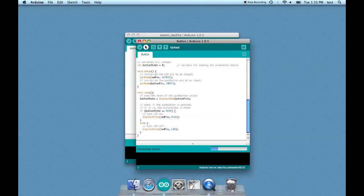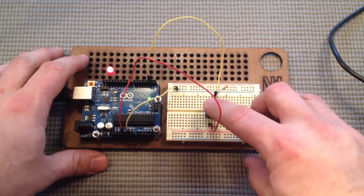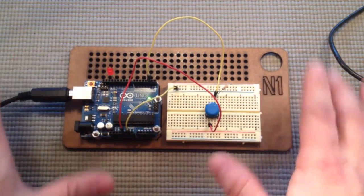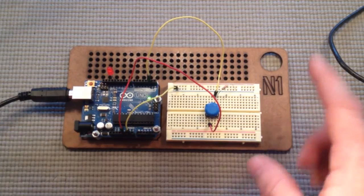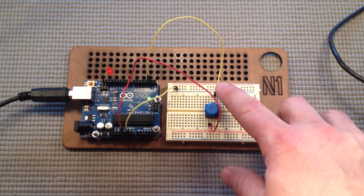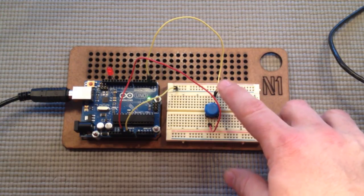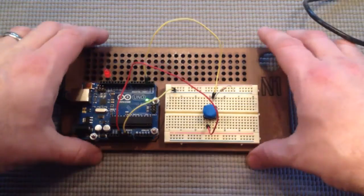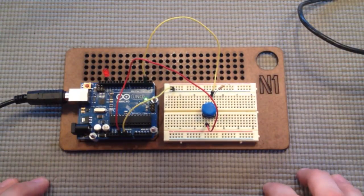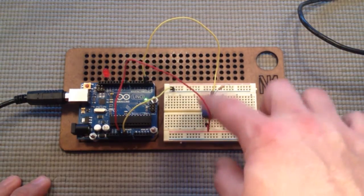Let's upload it. Okay, let's test it — yeah, check it out! The only thing I have to clarify is I misspoke: the 10K resistor is brown black orange gold, not brown black red gold. I'll explain more in a future lesson about what all those colors mean, but the 10K is what you need to make this work.